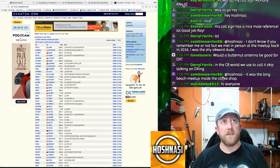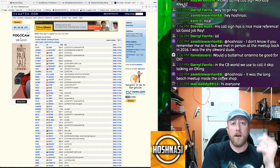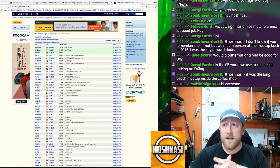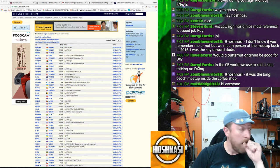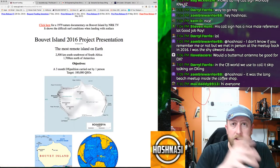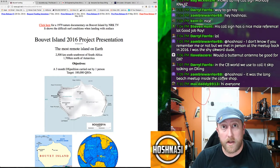What will often happen is you're going to hear the people that are chasing the DXers, but you may not hear the destination you're trying to hit. That's for a number of reasons. The people that are trying to hit the DXer may be in between you and the DX location, and they have a stronger signal to you, or any number of things. So the reason why we're talking about this, now that you've got an understanding of DX, it just means really long-distance communication.